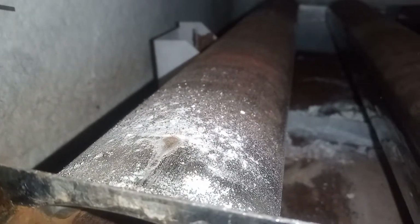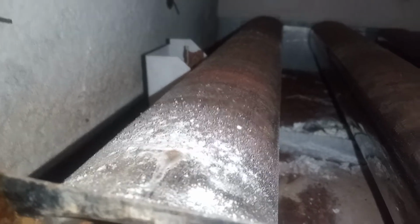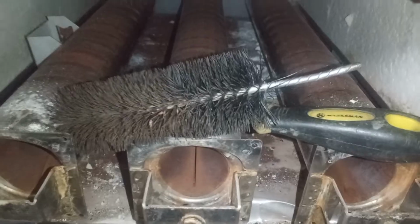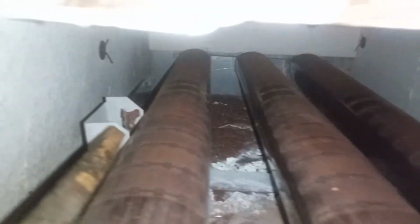Gonna give it a clean down, and then once I finish with this and get the unit on and the shunt pump running, then I'm gonna make some adjustments to my pressurization unit, pump up the expansion vessel. Get my brush and my file. Time to give it a clean. Okay, it's a bit better. Okay, giving that a file down, ionization probe, let's see if it lights.